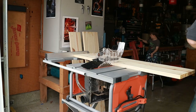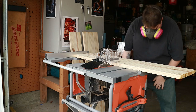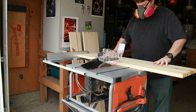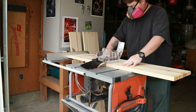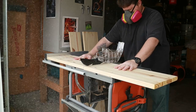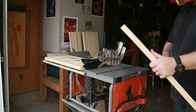The first thing I'm going to do is cut all of my boards down to size. For the two legs I'm using one full board cut directly in half. For these first few cuts I've set my rip fence to 24 inches from the blade. This type of cut where you're cutting a long board through the short side is called a cross cut; if you cut a board along its length that is called a rip. What I'm doing here is maybe just a little bit sketchy — you shouldn't use the rip fence for making cross cuts, but I find the miter gauge to be completely useless for boards of this size and I don't have a cross cut sled. That's a project for another episode, so I'm doing it this way.